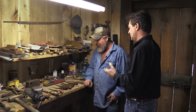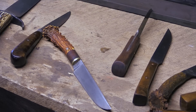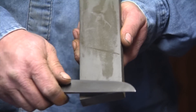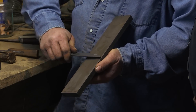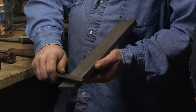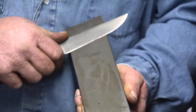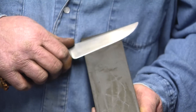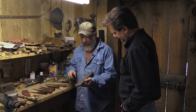I want to hear from a guy who makes and uses knives — I want to see you sharpen a knife and tell us why you do it that particular way. When you sharpen a knife, I'll just hold it here — I generally don't even lay them down. Hold that blade down and bring it up just a little bit and you can feel it drag. You want to act like you're trying to shave the top of that stone off. Keep your arm good and stiff — you don't want to go wobbling it. Make a few licks like that, and back the other way. Keep a little oil on these stones. If you have one of these old stones, take some dish detergent or alcohol and wash it out, get those pores cleaned out so it still cuts — because you're actually taking off steel.